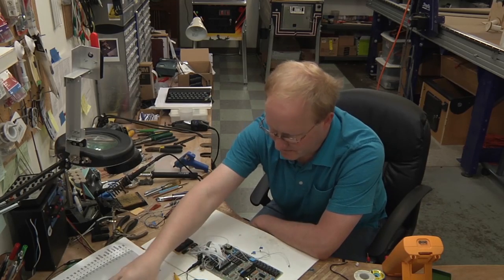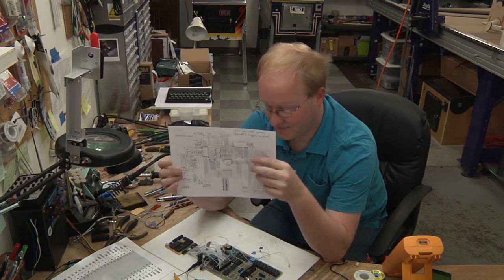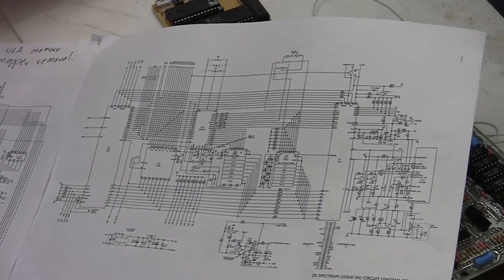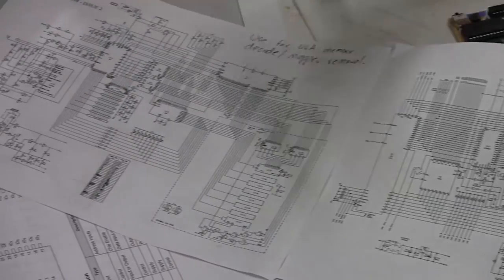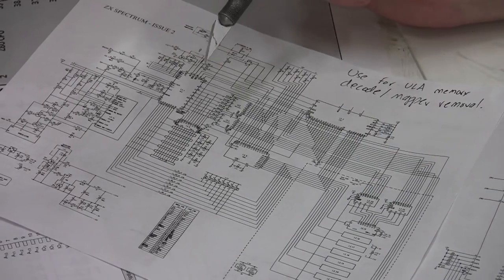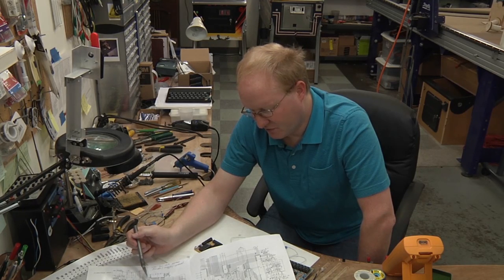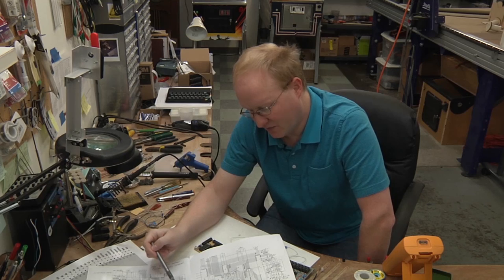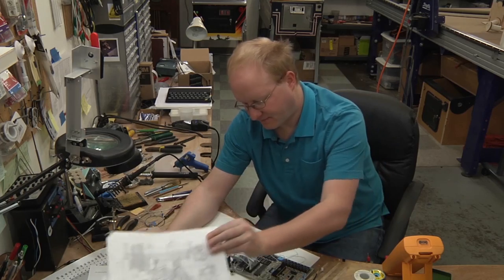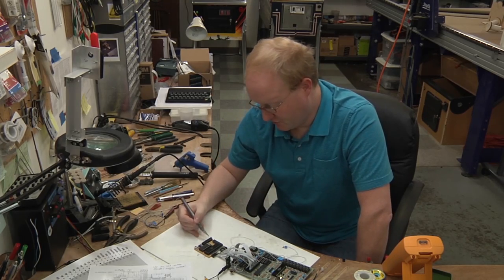This is basically another memory decoding chip. I have two separate sets of schematics — this is an older ZX Spectrum, whereas this is basically the last model that existed, so it's been optimized. The older version had six integrated circuits in place of that one large IC. All that logic basically takes the 16-bit bus and turns it into two different buses to address the single-bit RAM. But we have modern RAM now, so instead of a large DIP-40 we can get away with just two smaller gates.